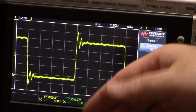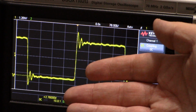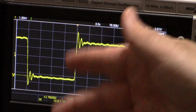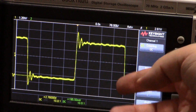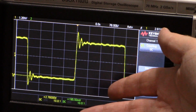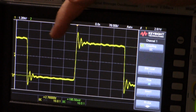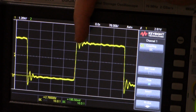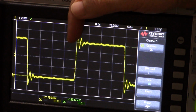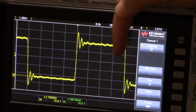So if we invert that, we get the time to switch. So roughly 3.2 megahertz. That's right, I said megahertz. The microcontroller operates at about 16 megahertz. So if I divide that in, I get about 4.992. 16 megahertz divided by 3.2-ish megahertz is about 5. If you round off, it's about 5. So it seems to be taking about 5 cycles of the microcontroller to switch. And it's definitely switching. There's interference, there's nastiness, but it's not like it's half switching, it's not like it's angled or anything. It's nice, hard switches.